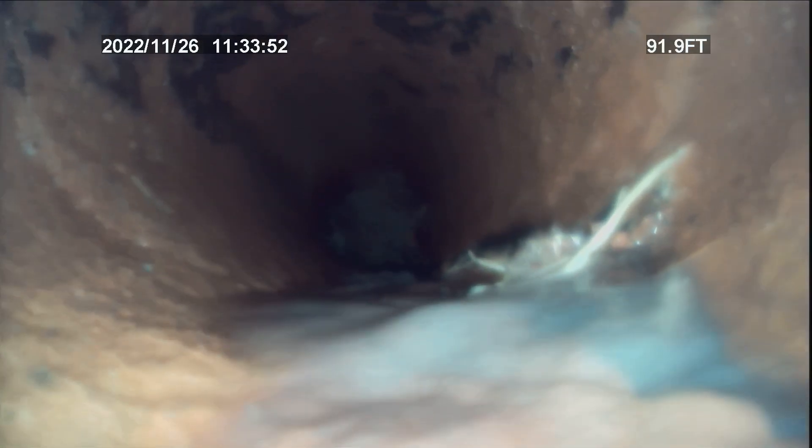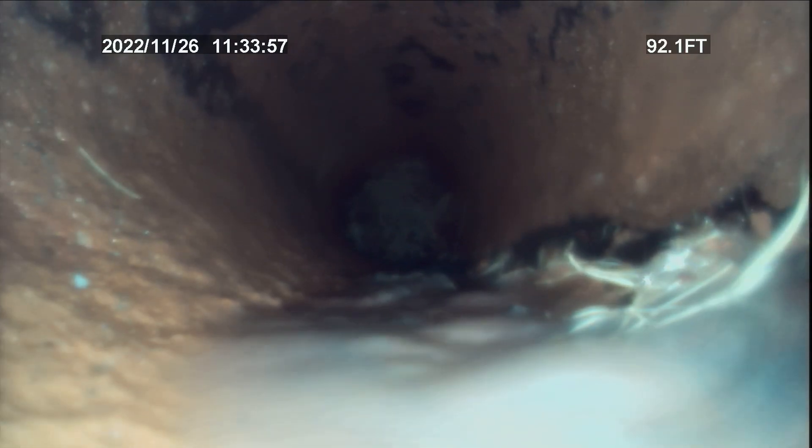It's JJ Wolf and Peyton Putney out here on job number 377-339-53. It's an upload video. We're continuing not to jet at this point. There's a crack in the pipe that's actually seen on the bottom right hand side — it actually goes down and there's a cavity right for that root. There's a root right there. So we'll start pulling back. At this point we cannot jet any longer down on this line just because of the break in the line.